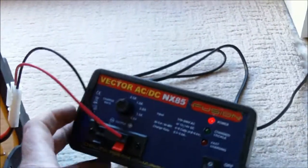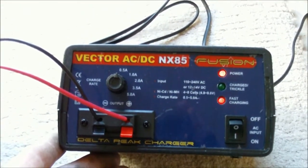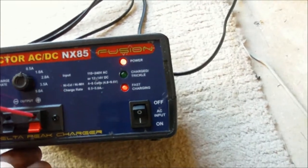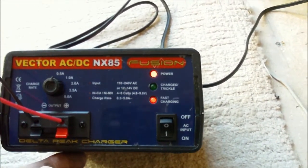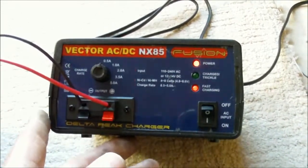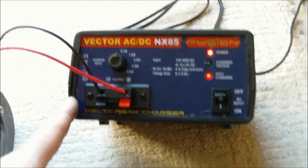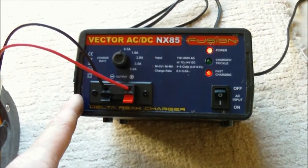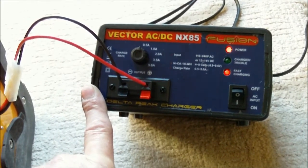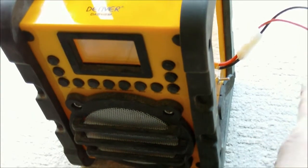This is the charger, and now it's charging. I've got the facility to charge from trickle charging at 0.5 amps all the way up to a boost charge at 5 amps. It's currently fast charging because the batteries are on their first charge. One note on nickel metal hydride batteries: they should always be fully charged on the first point of use. Then, after two complete discharges, you will have about 100% of the battery's capacity. It has to structure itself within the battery cell component. Once it's done that, you get the full rated capacity — in this case 10,000mAh, which is 10 amp hours.